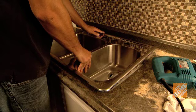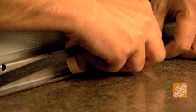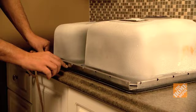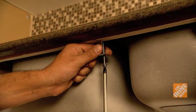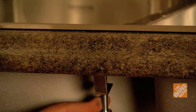Check that the sink fits into the larger opening. Remove the new sink and clean the sawdust off the surface. Place the sink upside down on the countertop and attach the rubber gasket or run a bead of silicone caulk around the edge. Turn the sink over again and fit it into the opening, pressing firmly around the edge. In the cabinet below, attach the sink to the countertop using sink clips.